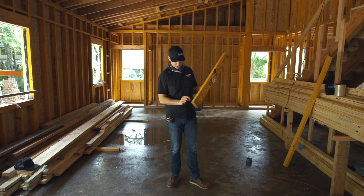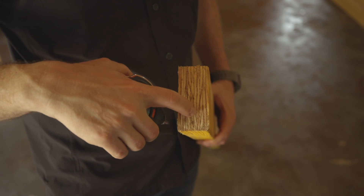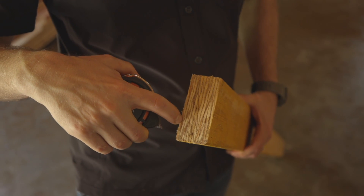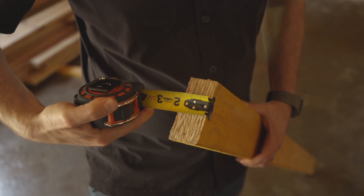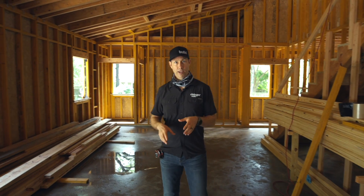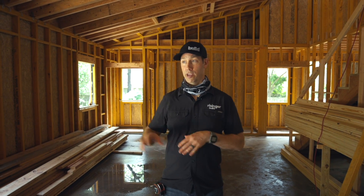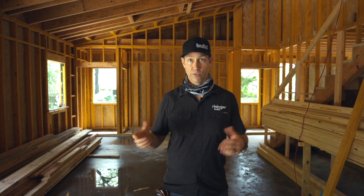If you count the plies on this one, I counted 11 plies, and you can see that's a very thick ply — unlike plywood that has real thin plies. They're very thick plies, and as they glue those together in the factory they alternate the grain pattern so that in that small thickness footprint — inch and a half by three and a half inches — you actually get a piece of wood that's stronger than a solid piece of wood, which we've known for years because we've used them for headers.